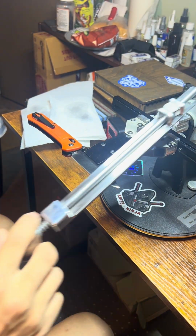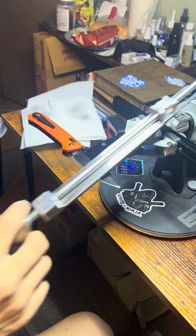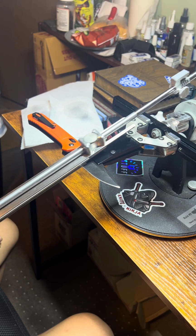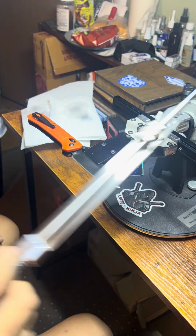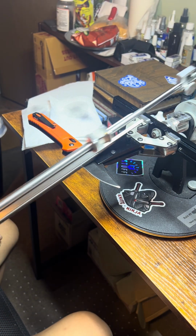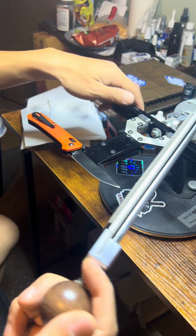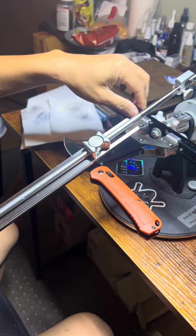These are Poltava metallic bonded CBN stones, or I think it's cubic boron nitride. I think it's a little less hard than diamond, but it's got, I believe, more cutting facets. And it leaves a finish I like, and an edge aggression I like.